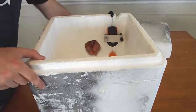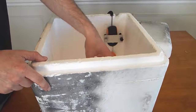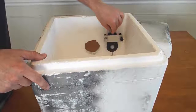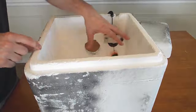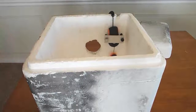Basically what we're trying to achieve is we're going to fire our light in here and bounce it off this back wall, off the white, and all through here, and then when we measure it, the flashlight isn't firing directly into that sensor. We even out the light as best we can and then measure it.